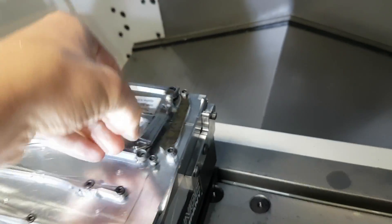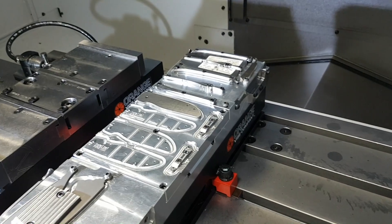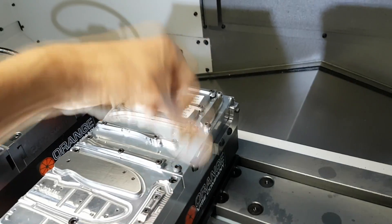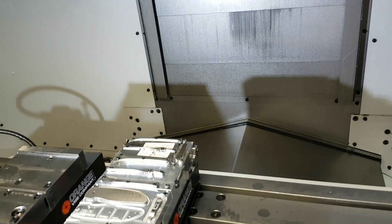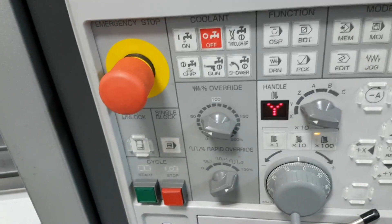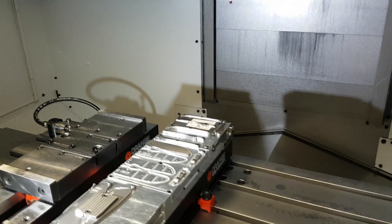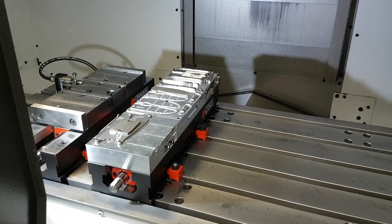The cool way I set up this fixture is it's one-piece flow and I could do two complete knives at a time, but when working with Tymascus the recipe is a little different — there are a couple extra tool paths. So I'm just going to work on one knife: backside of the handles and the clip. My only speeds and feeds trick — and this is not science yet but it works — is I set my feed rate override knob to 50%. Titanium is at 100%, Tymascus is at 50%. It takes twice as long, but otherwise I burn up cutters or break them a lot faster. At 50% I'm getting pretty good life out of them.